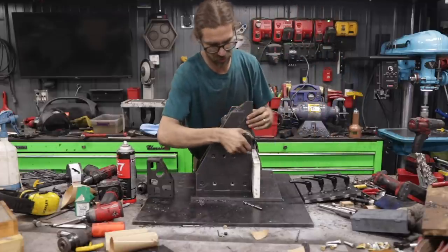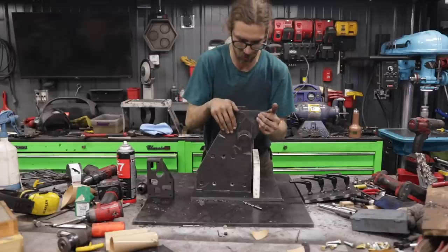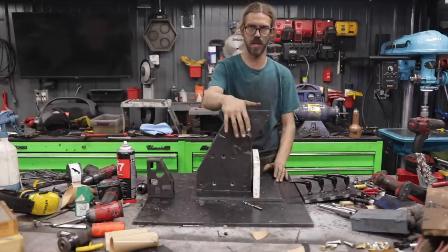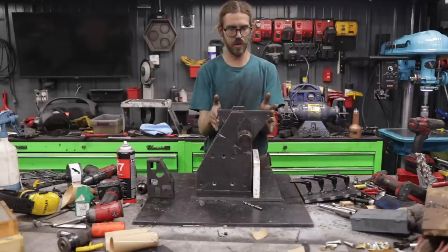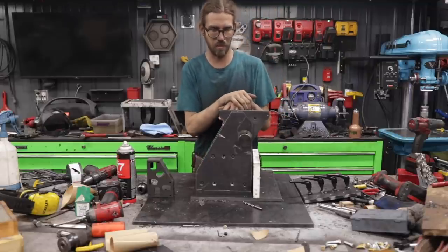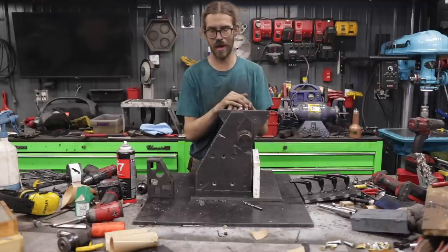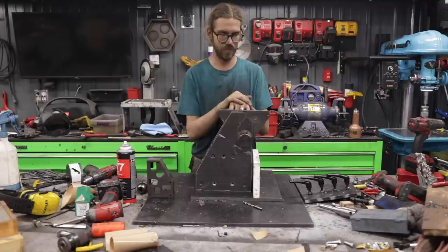This plunger is gonna allow it to be pulled out, and then this whole thing can rotate, and then it'll find its home right there. That is the way it's gonna rotate from horizontal to vertical. Now, typically you would do like a cutout or a notch that you'd route out on a mill, but by doing this, it allows you to avoid doing that. And I actually like it a little bit better because you don't have to tighten it down.